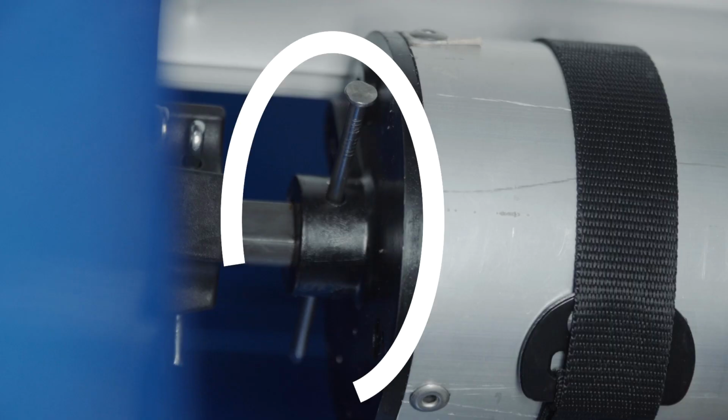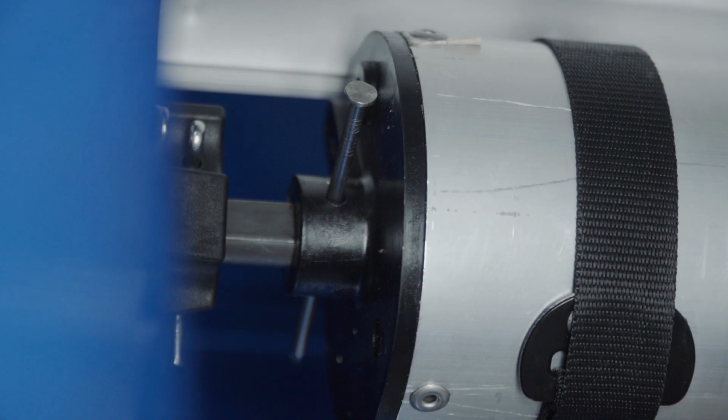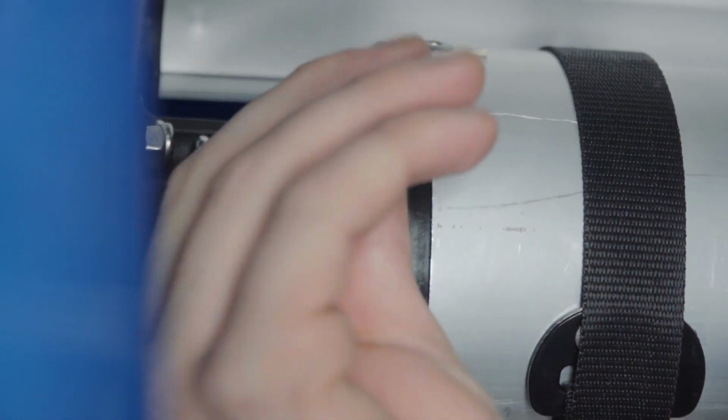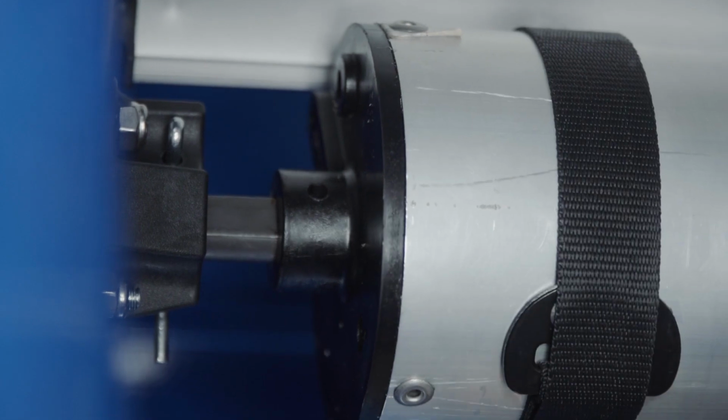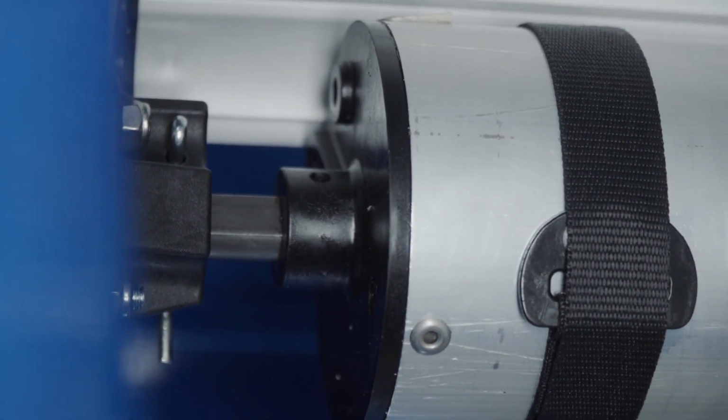Removing the retaining pin will release spring tension on the tube, and the spring will act as a counterbalance to the weight of the curtain. When removing this pin, the installation technician should use a firm hand to pull on and maintain tension on the top edge of the curtain to relieve spring pressure on the pin, making it easier to pull out.